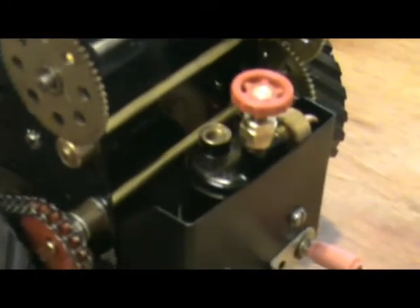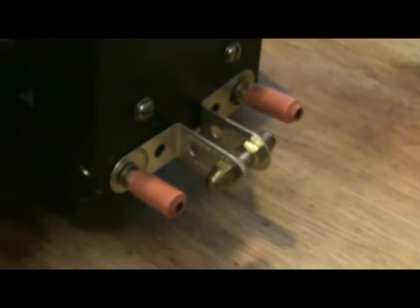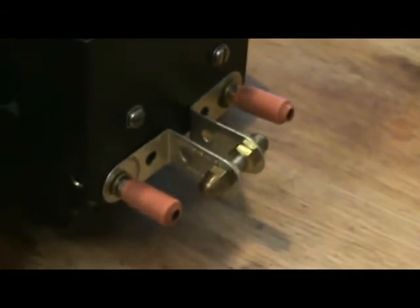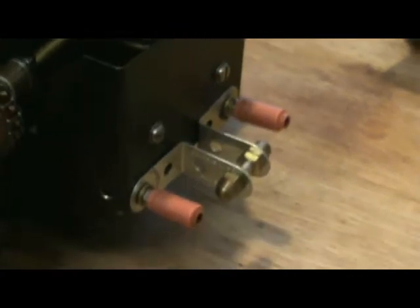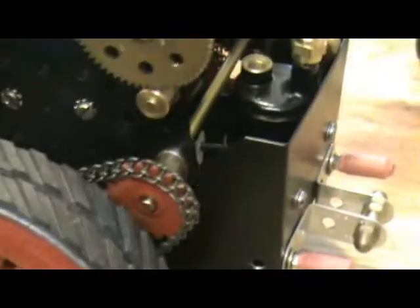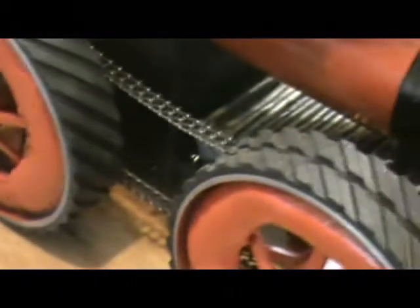There's the burner in the standard scuttle there. On this burner I've added the crankshaft hook — of course it didn't have one — and I've reinforced it. The last shaft on the gear train has a sprocket on the end, which drives a short chain to a sprocket on the rear axle. And then the rear axle is coupled to the front axle by chain.